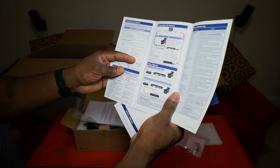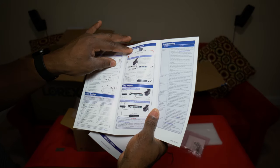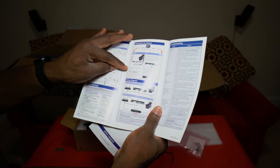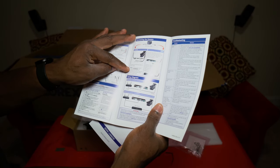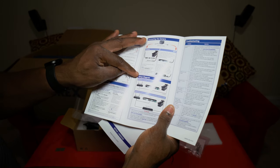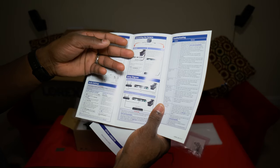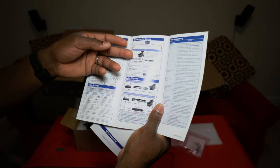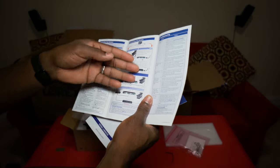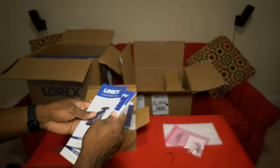All right, connecting the camera. As you see, that power connection is optional. Connecting the camera, use Ethernet on both sides. And note, the 12-volt DC power adapter is not included. It's only required if connecting the camera's Ethernet cable to a router or switch that does not support PoE. So if the router or switch doesn't support it, then in that case you would need the power. But in our case, everything is compatible. It's a system, so we're good to go, okay?